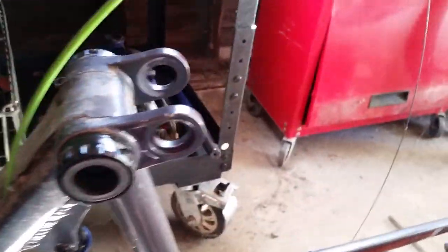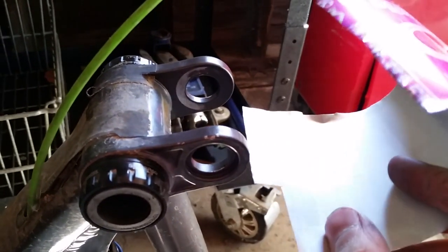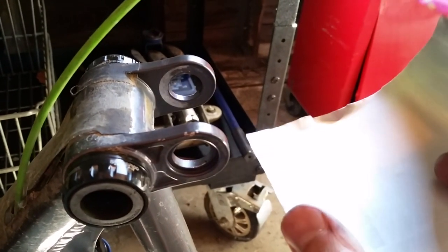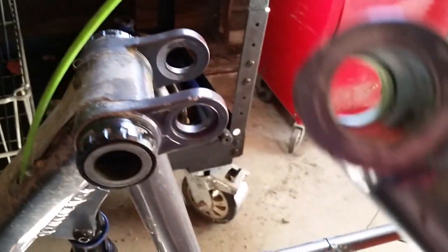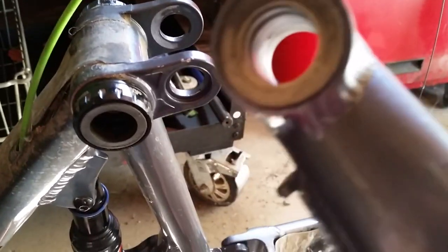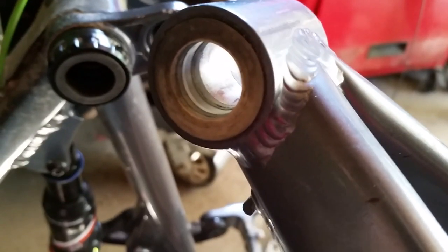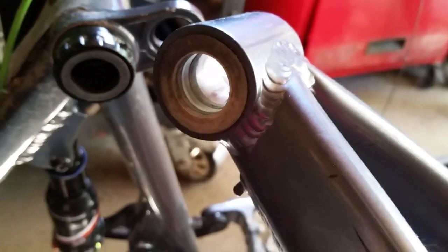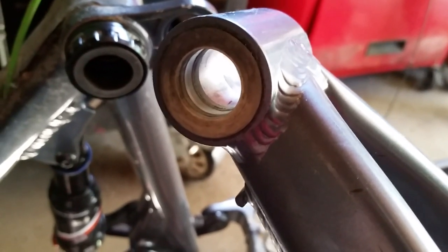What I'm going to do is add an extra layer of material to kind of stiffen that hole up. I'm going to use just a little bit of soda can, and hopefully that'll be enough material to stiffen that up and give that metal something else to wear on besides the plastic. I don't know where to get replacement plastic grommets, so I'm better off just using soda can that I can easily replace if needed.